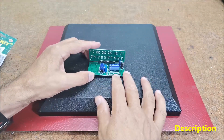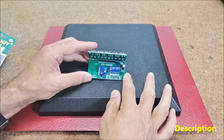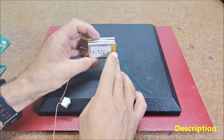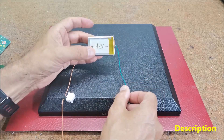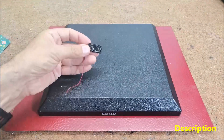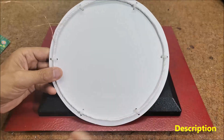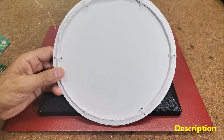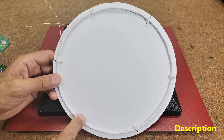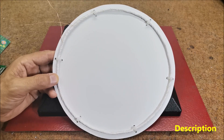To make a complete functional device we need to connect a battery, speaker, and search coil to the module. For the power source I use three lithium-ion batteries connected in series, just under 12 volts. This is a small laptop speaker, and the coil is identical to one I use in my do-it-yourself pulse induction metal detectors — consisting of 25 turns of enameled copper wire with a diameter of 0.4 to 0.6 millimeters. The diameter of the coil is 200 millimeters.